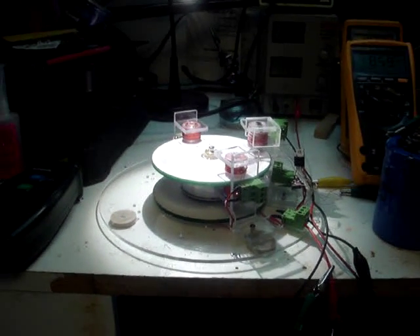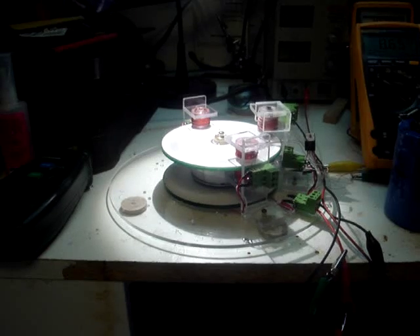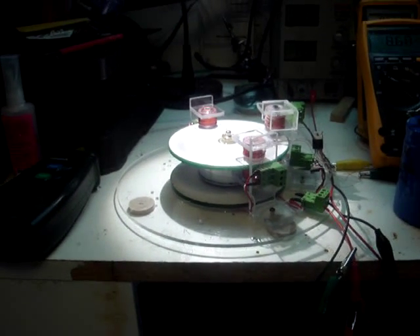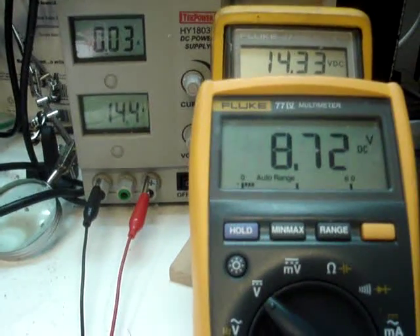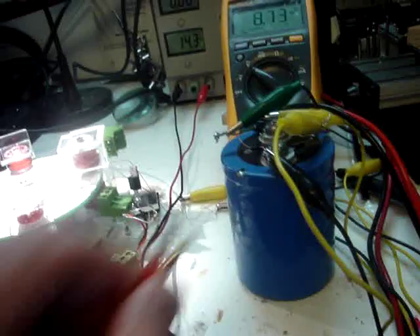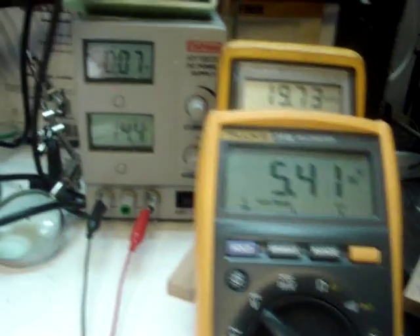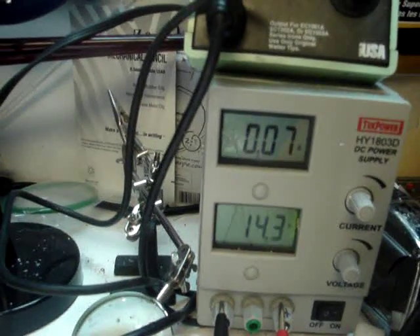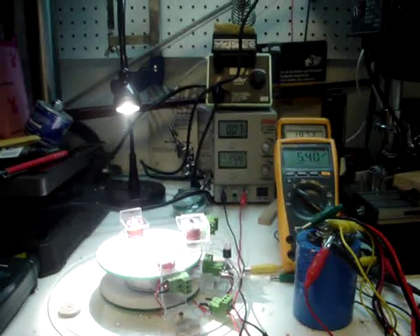That's just what I wanted to show. I don't know if I can add a couple more coils — I had all the coils on the other day and it just vibrated to death. I'm going to try to add one coil, braced at a time, and see how everything pans out. Right now the power supply, with these two output coils in parallel, is giving me 8.71 volts. I can wire it back into the circuit and you'll hear it wind up. The voltage again stabilizes around 5.41, about 70 milliamps from the series circuit, 19.72 volts on the motor. This has been Worn Out K4ZEP, from the world's smallest — and getting smaller every day — lab. Take care, goodbye.